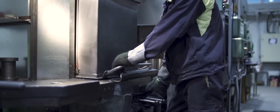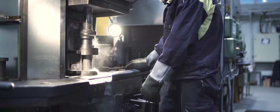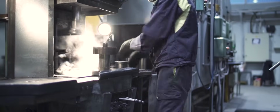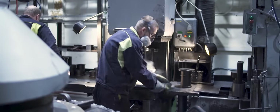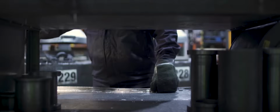Pour it slightly unevenly, and air bubbles will fill the grooves. Cool it too fast, and the metal shrinks, resulting in vacuum bubbles. Do it in higher than required humidity, and the composition will be completely ruined, as excess water in the air will end up in molten aluminum, where in turn, it breaks down to oxygen and hydrogen, forming unwanted oxygen slag and hydrogen bubbles.